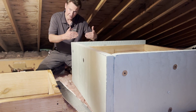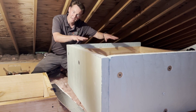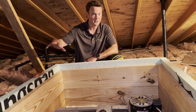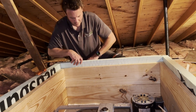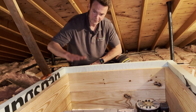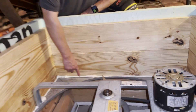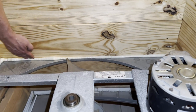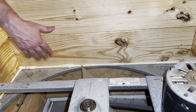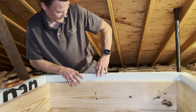We brought the green board up 2 inches higher than the wooden wall all the way around — this is what's going to act to hold our lid in place once we have that made. Next step: now that we've got the 2-inch thick insulated foam board attached along the sides with screws and washers, we're going to put a band of weather stripping on top of this lip. It's nice and even and level all the way around so our lid's going to sit flush. There was a gap all along the edge here and we sealed it with foam — any way around the bottom of your house fan that could be connected to the rest of the attic, you want to seal with a bead of foam.